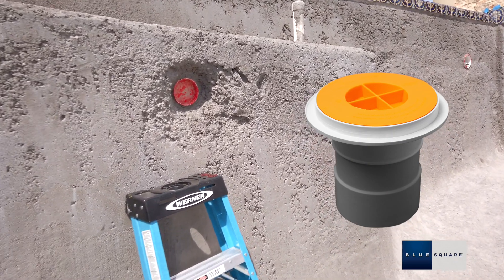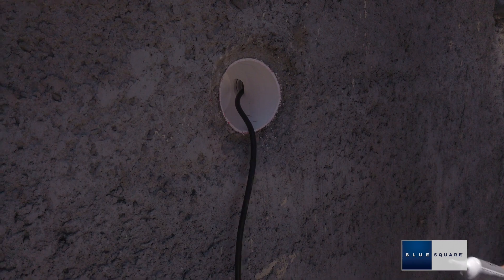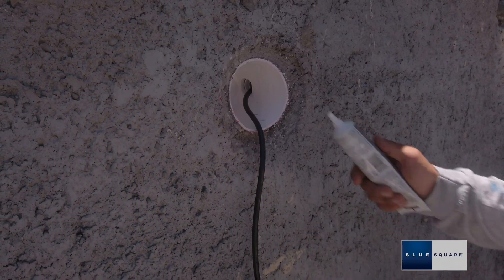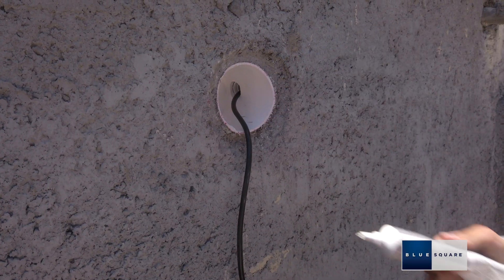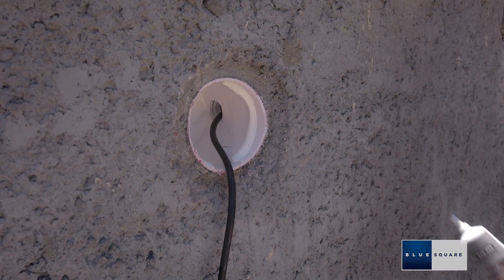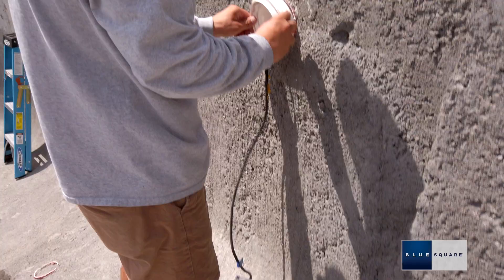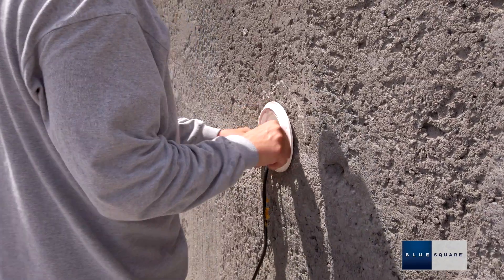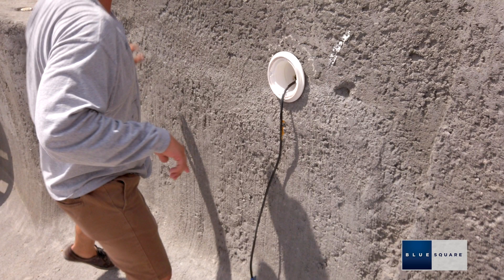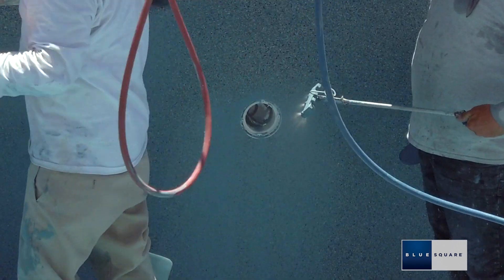If the niche has been set back too far in the wall, then the extended plaster ring is available. Use the adhesive provided in the kit to secure the adjustable plaster ring inside the niche to your required depth and alignment. Liberally apply the adhesive provided in the kit to the plaster ring to ensure a watertight installation. Set the plaster ring to your required depth and alignment, then push the plaster cap into the adjustable plaster ring. The pool interior should finish flush with the front face of the adjustable plaster ring.